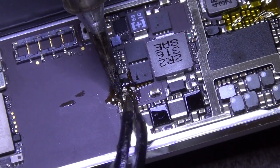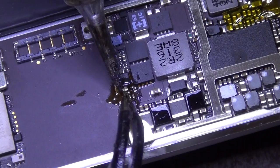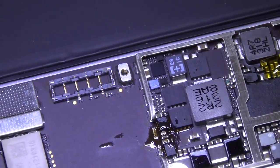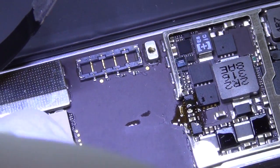This work is really hard to do without the desoldering alloy I'm using. That's why when you buy any repair kit from my website, I always include a little bit of flux and a little bit of desoldering alloy — just enough to do the job you purchased. I only replaced the filter here. You can also change the diode at the same time if you want, but I want to show that you don't necessarily need to change all parts if the others are still good. Always try to connect the battery last to avoid shorting anything.